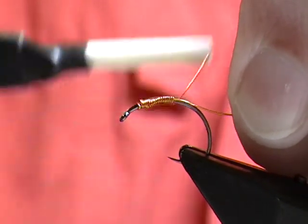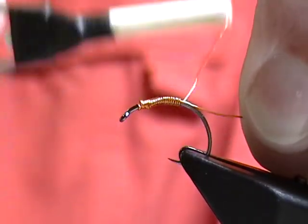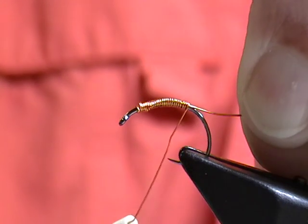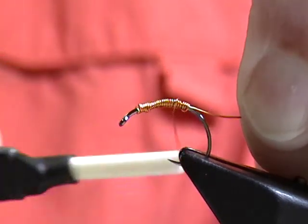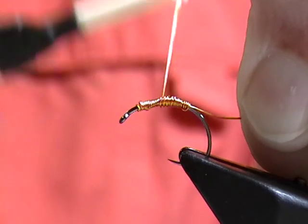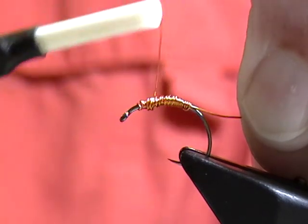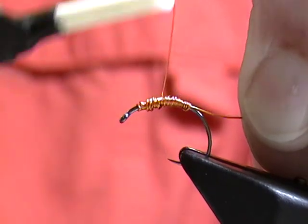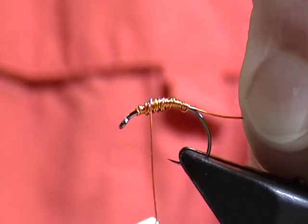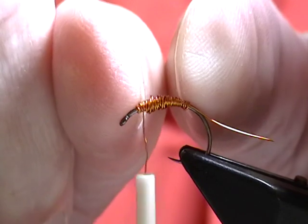Do a number of turns. The wire I'm using here is magnet wire, which is what most of the colored copper wires are. This magnet wire is 32 gauge, which is easy to work with and flexible enough to add on. You'll notice I'm building up, not going all the way back — each time coming a little short of where I was previously, so I can actually build up a taper, each one just a little bit narrower than the previous, starting wide and getting narrower as I go.